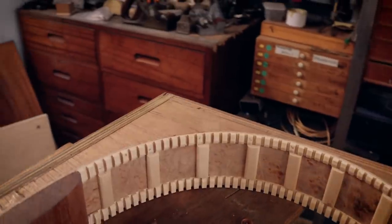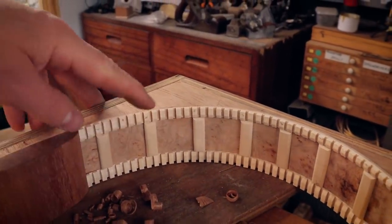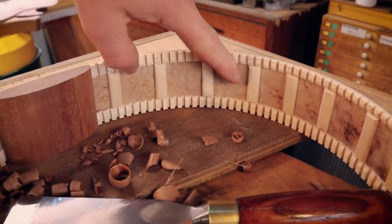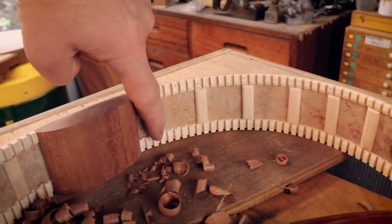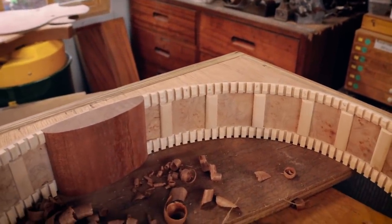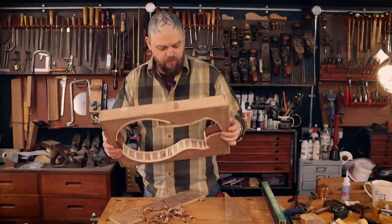The other option is I bend another piece of material and have it so my jack would be there and have a piece of material go across those four supports. And it solidifies that whole section, and we'll have the jack going through there. I'd obviously fill that as well. It wouldn't be wrong to put an end pin jack on there, from a technical point of view, from a use point of view, etc. It just, with a guitar of this shape and size, it's just a little weird, really. But that will be in a different episode.